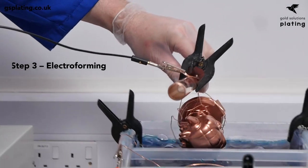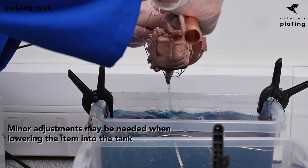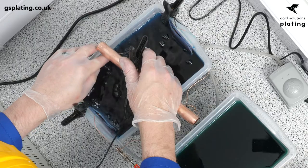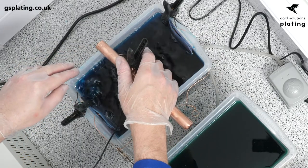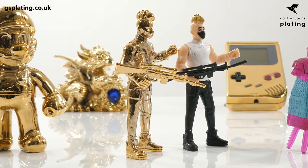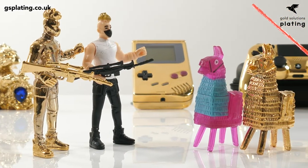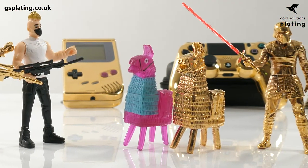Next, lower the rigged item into the electroforming tank at 0.035 amps per centimeter squared. With the electroforming kit all of the issues surrounding polishing are taken care of, and the end results are strong and durable. Thanks to our Mirrotec system, no polish is required at any stage — your items will come out of the tank with chrome levels of shine and you will have a truly metal feel.